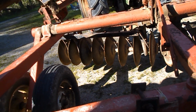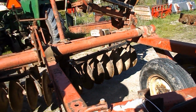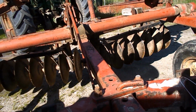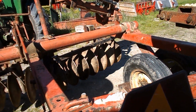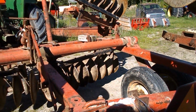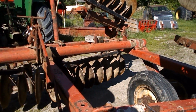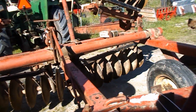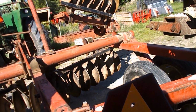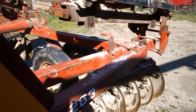The wheel bearings are all tightened up now. They've all been greased to where I'm happy with them. They were pretty dry because there was just about a tube of grease put in all 4 of these hubs. That tells you how little was in them.